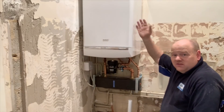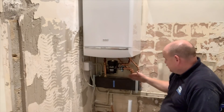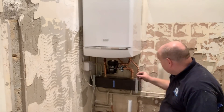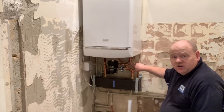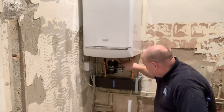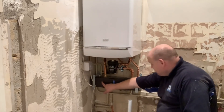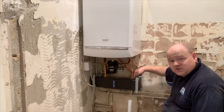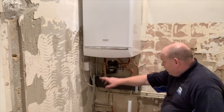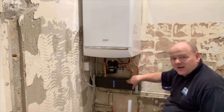In real jobs we've got to work with the space that we've got — ideally we'd have a lot more space here. That return goes back into the boiler, and on this side the flow goes into the low loss header. The return is also in the low loss header, so what that allows is the boiler can pump around here and continually pump — it acts a bit like a bypass.